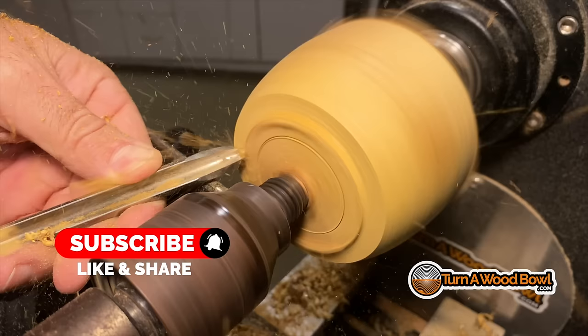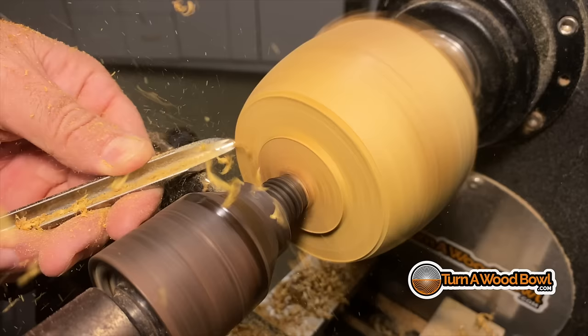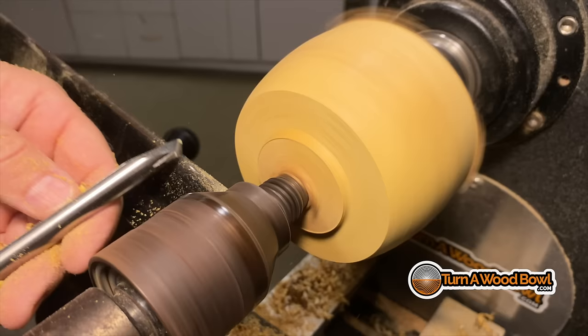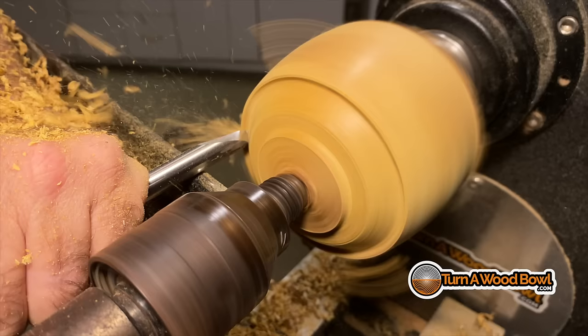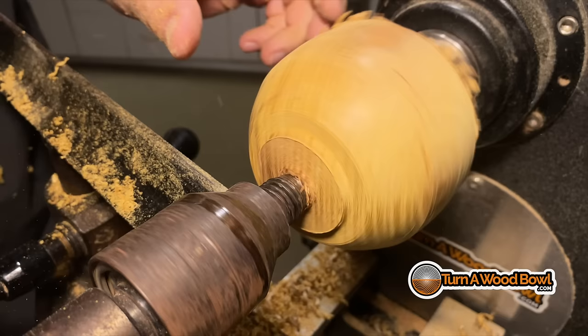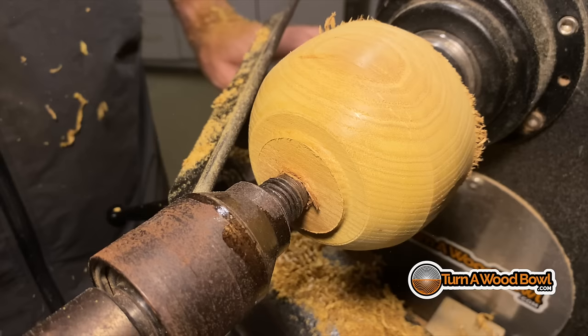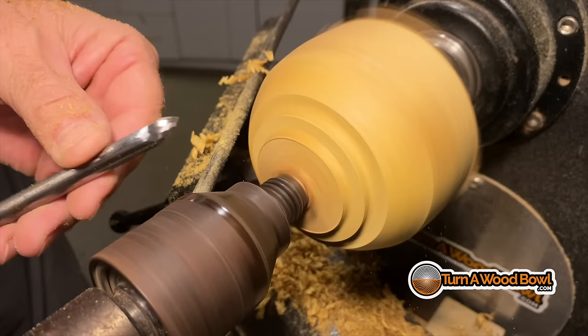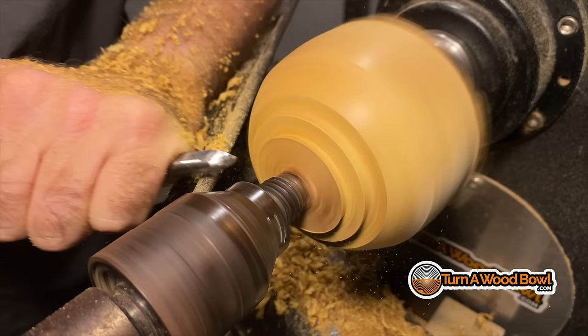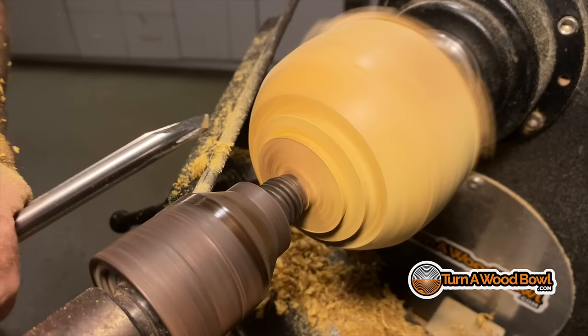If you're not already subscribing, please consider subscribing and click that bell — that way you'll be notified each time a new video comes out. So with the tenon cylinder shaped, I'm going to continue making that curve on the exterior of this piece. Mulberry has something really elegant about it — a really tight grain that's pretty up close and looks good from a distance. Most fruit-bearing trees have dense wood-grain fibers and are typically very nice for turning. I'm using my spindle detail gouge to shape the dovetail for the tenon and clean up that inside edge, then I'll switch back to my half-inch bowl gouge to continue shaping the exterior.